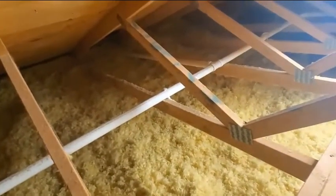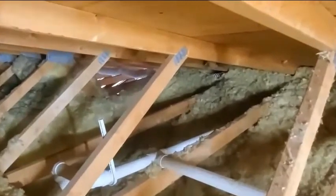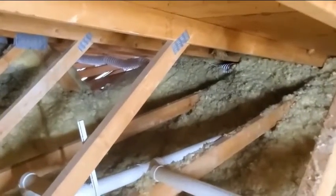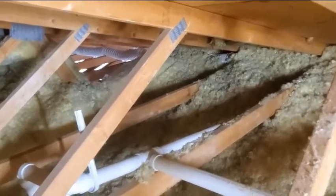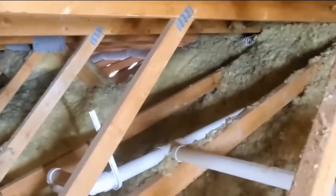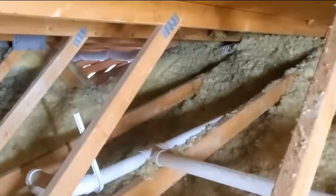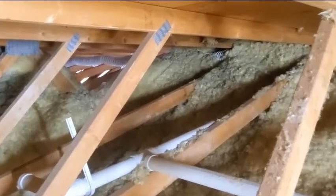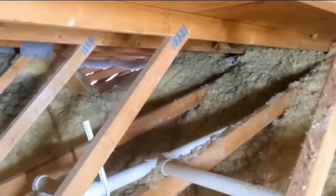In our case we do know it's vented to the outside, so let's take a look at the venting for this fan. We can follow from the fan location and we can see our venting is a vinyl flex vent coming out from under the insulation. It goes across the vented soffit of a porch, and we can see some sagging there. Two issues: one, this long flexible vent can really reduce our airflow, which could account for some of the low airflow we measured.